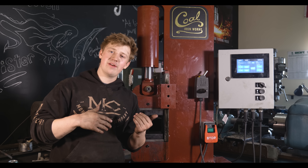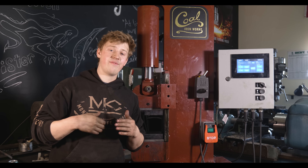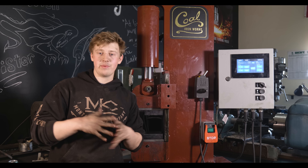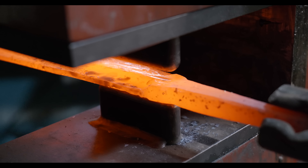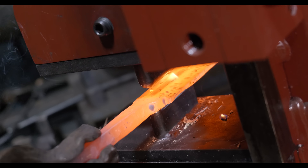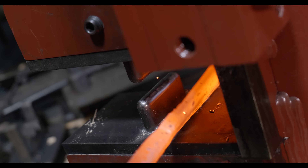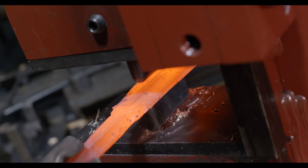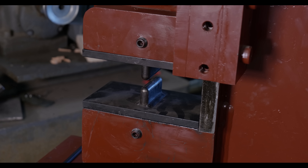It may not sound like it's that big of a deal, but trust me, it makes a really big difference for that final little bit of cleanup work. I've used it cutting in fullers with some of the 5/8-inch wide fullering dies that I have. It's really nice for doing the final dimensioning on billets of Damascus. It's great for getting stuff rounded out. If you want round bar, you can make round bar using flat dies with this thing, and that is insane.